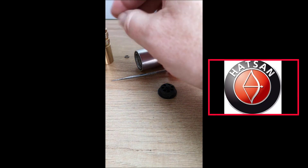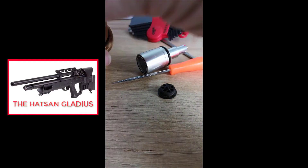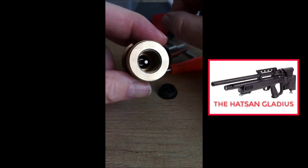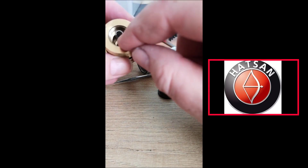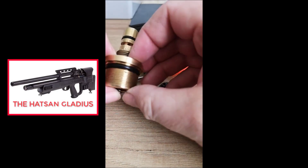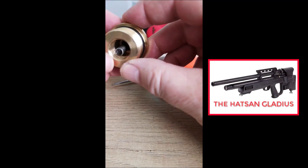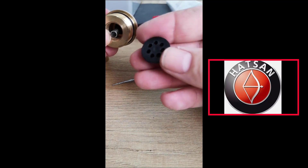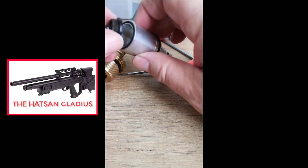The spacer has just come out — there's a spacer in there for the actual regulator. The spring fits inside and that keeps tension on the valve stem so the air can't get out until the hammer opens it. I'll get all the modification done on the actual valve cap, and I'll send this to Robert Lane so he realizes what the problem is, because he won't know that's the problem.